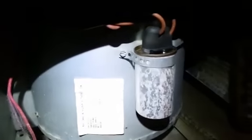You gotta love it. We can look inside the unit and see that the coil plate is falling off. Air's gonna be bypassing through the center of the coil. Not a major deal. It's kind of rusted out. Looks like the screw hole's still good right down there, so I don't know what the deal is. That is a large looking capacitor for the blower. We're going to check that and see what kind of capacitance rating that thing has.